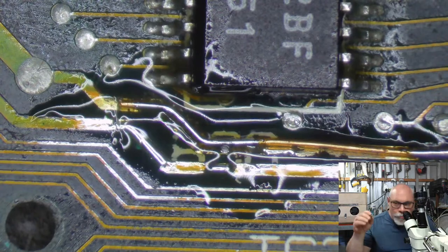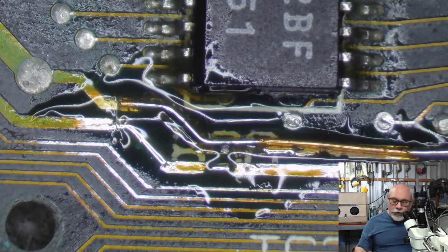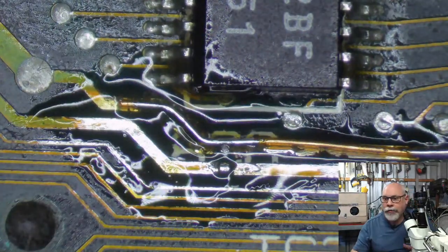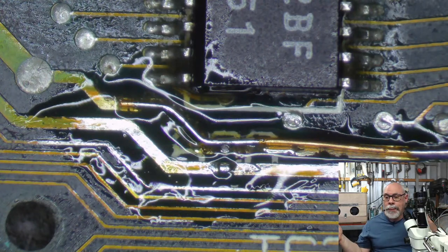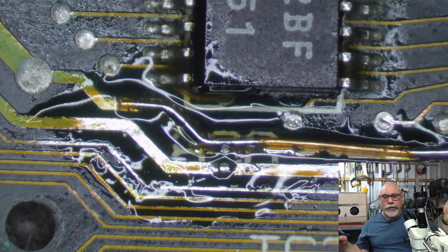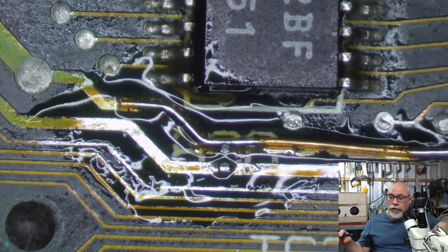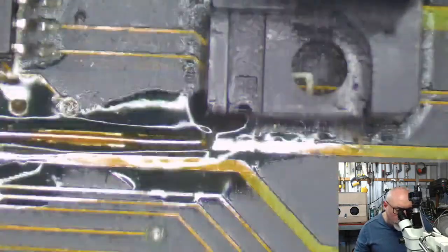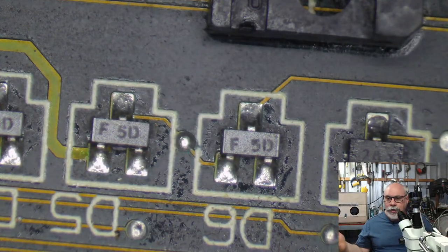Now what you can do is set up multiple drives on the SCSI2SD as an emulator. You can set up multiple IDs, so you can set up one drive for ID 4, one for 5, one for 6. Then you can go into the SCSI2SD utility and tell it that you want this one to be ID 6, and then you can change it. You can go back and say, okay, I don't want this one to be 6, I want this one to be 6, and you shuffle the numbers around so that the one you want to boot from will be ID 6, and then you can select which one you want to boot from that way. But it's unfortunately not just a simple matter of getting a whole bunch of partitions if you want to be able to choose what to boot from.